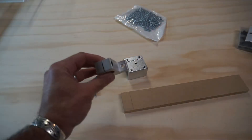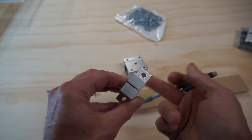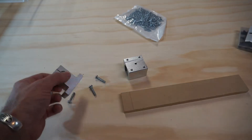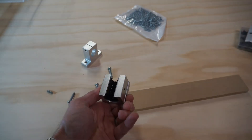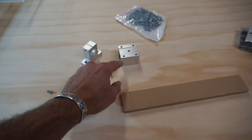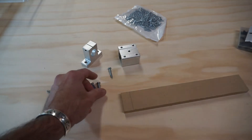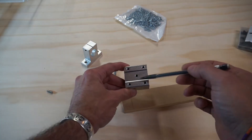There are some components like this that have a pass-through hole, meaning the hole goes all the way through the piece, and it's easy as putting on your workpiece and using a pencil or a scribing tool to just mark the location where you want to drill the hole. Now in the case of this component, I don't have that luxury — the holes do not go all the way through. This is an adjustment hole; it is not what I'm using to attach this roller.